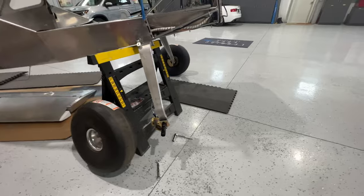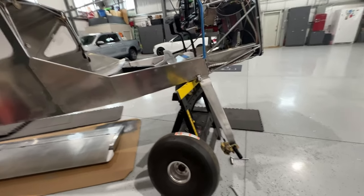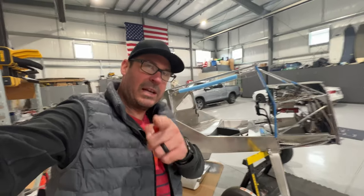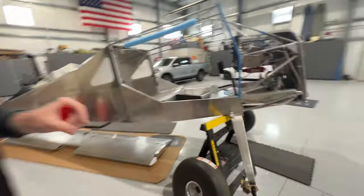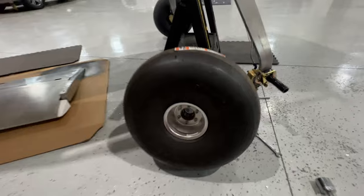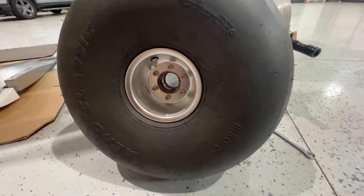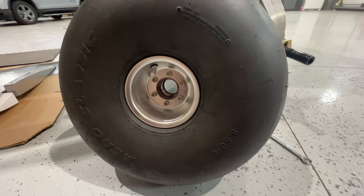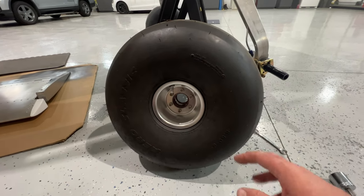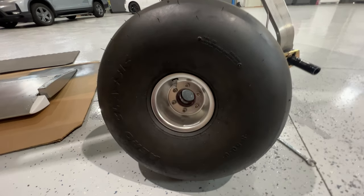The only issue I'm running into — first, a couple of comments that people have made, which goes back to the reason why I'm putting this all on YouTube, because I am a first-time builder and you guys have my back — I thank you for that. The first comment I'll address is a mistake I made: I torqued the bolts down that connect the two halves of the hub together after I had inflated the tire. It seems obvious now but just something you don't think about if you've never done it. I'm going to deflate it and re-torque those to the spec values.